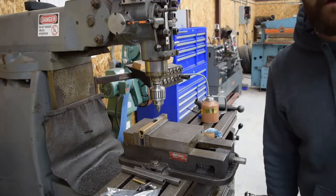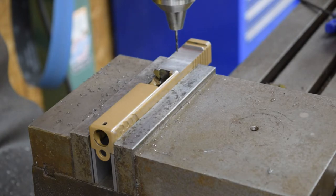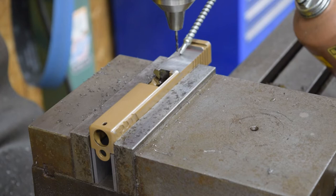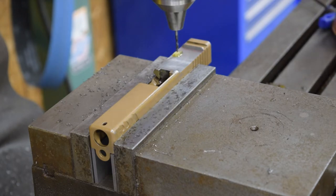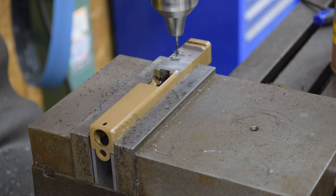Okay, time to cut a hole. We're going to slow it down — anytime you're drilling a hole in hard steel you want to slow it down. Add a little oil. Let's go nice and easy; we don't want to snap a bit, especially when they're $16 a piece. This is a 1.5 mm drill bit.